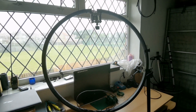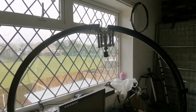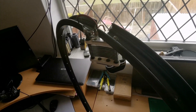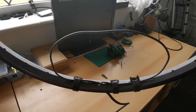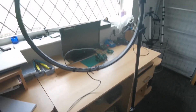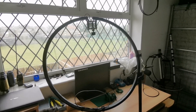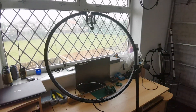It's here, just to run down on a 20 to 26-inch bike wheel and the capacitor is 5pF to 200pF. Nothing spectacular — I literally bolted it on one side, bolted on the other, and the coupling loop is just velcroed in place, squashed down a little bit. That was about 52 centimeters. It's on a little tripod for a quick and easy mount, running into the radio. We're going to see what we can do during the IOTA contest this weekend. I did work a few stations — I thought I'd share some footage.